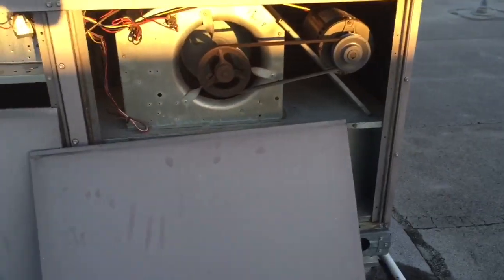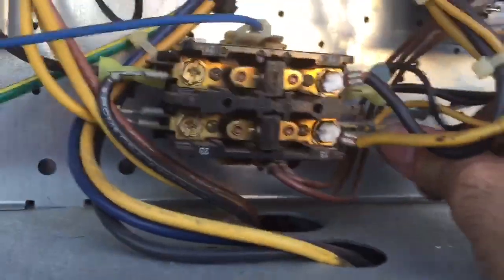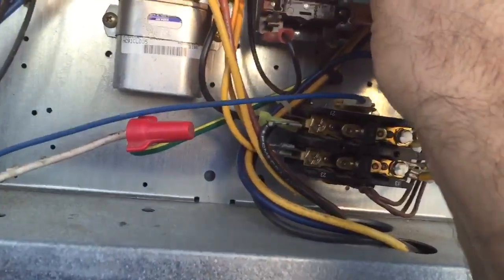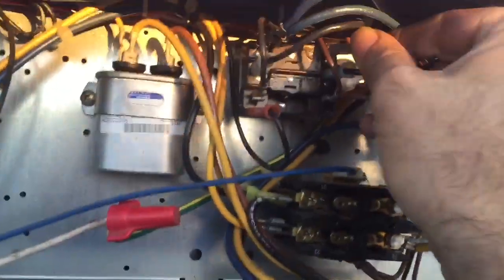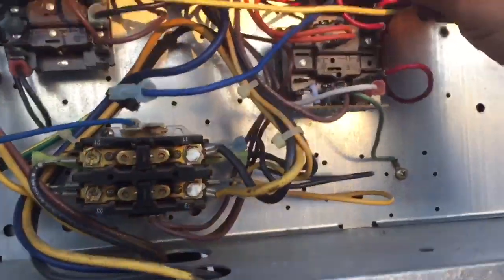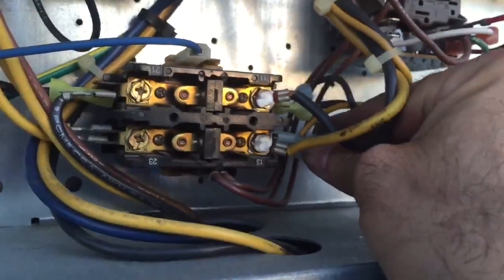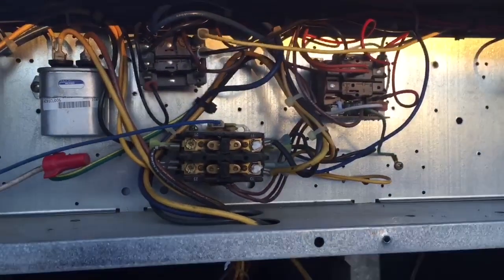So on this particular motor, all I'm going to do is switch out two leads. So that's blue — that's one wire. We're going to swap this yellow and this blue. We're going to take this one out, take this one out, put this yellow here, put this one blue. By swapping the wires, it will rotate it. Let's check it out guys.